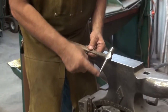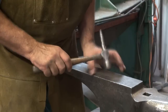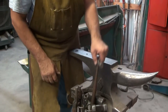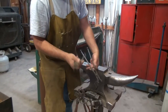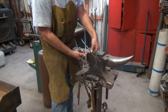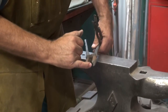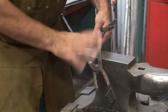Little picking hammer for working in the corners, for doing little detail work — small little head for when you don't want to wail on it. You just want to tap it, just work at it, just smooth it out a little bit. Now, these are tongs that I would use in the forge. You can tell this one's been used a lot for holding round stock, different sizes of round stock. Small wire, those smaller gauges — all different shapes and sizes.